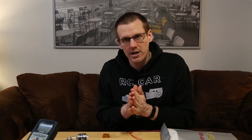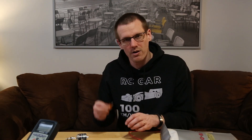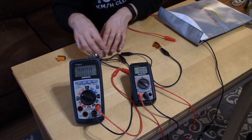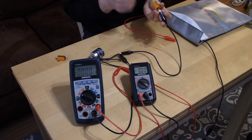It's very important to double-check the circuit. Make sure you don't have your motor connected directly to the battery — if you do that, you can fry your motor and possibly yourself. Make sure you're connecting your continuous circuit using one of the resistors. So here we have: negative out of the battery into the negative on the current meter, positive out of the current meter to one lead on the brushless motor, out another lead of the brushless motor to the power resistor, and the positive battery lead to the resistor completes our circuit.